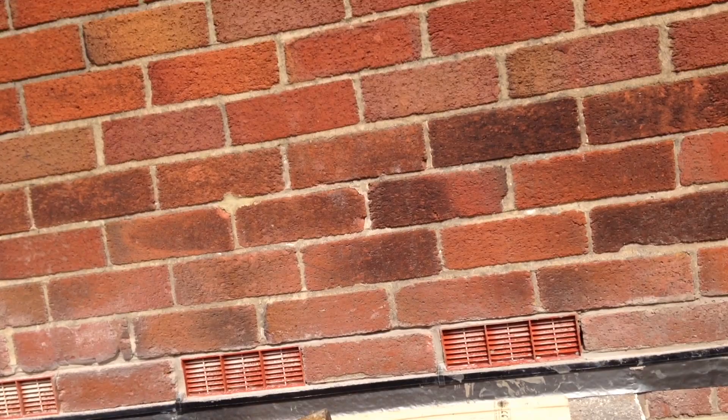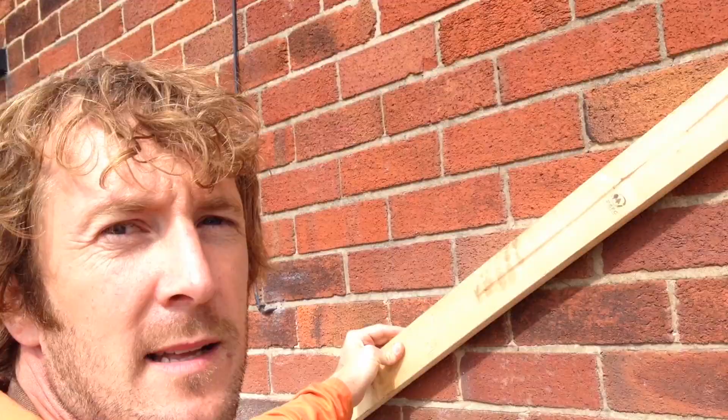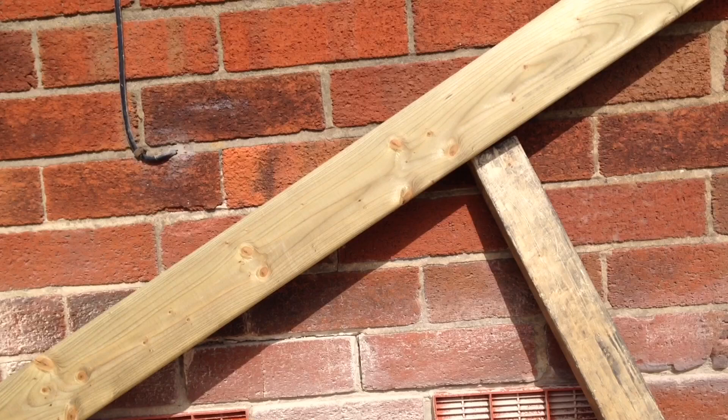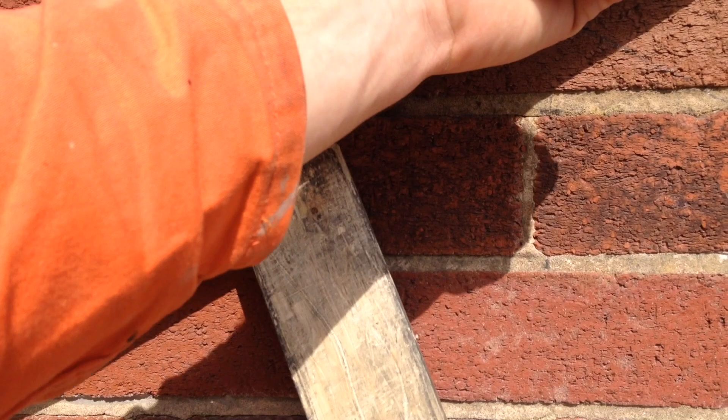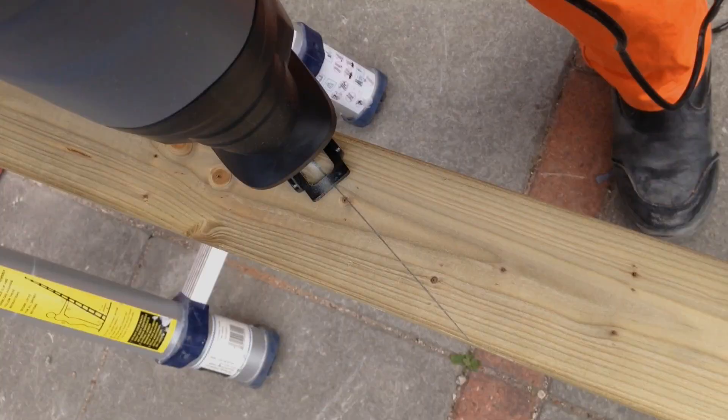I enlisted the help of my wife to decide the pitch of the roof — it's a brave man who does something like this without asking his wife's opinion. This first piece of wood is going to be the template for the rest of the roof, so it's important to get it correct. I've given myself some extra length from the centre line which I can chop off to the correct size later, and that allows me to come down to the bottom end and trace the angle, then go along with a saw and chop off the angle.